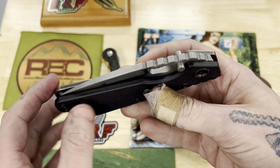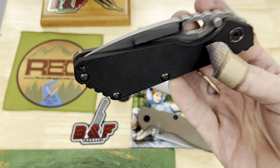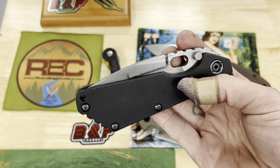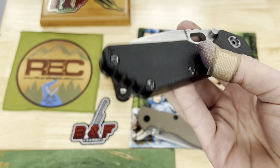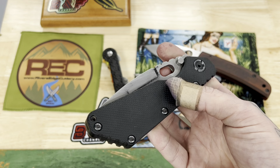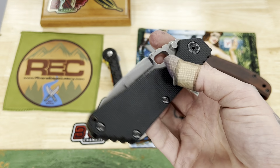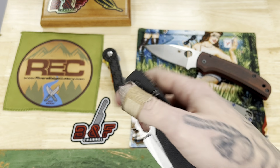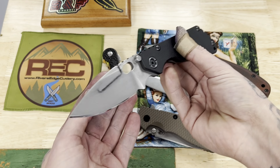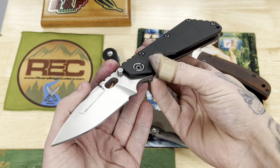This is the SMF, so this is a super fat blade stock. When you see the bevel on this, I guarantee nobody would ever guess that this edge is sharpened at 24 degrees per side. And that is with the angle cube, the actual degrees per side. On the KME, it was a little bit above 25 degrees on the adjuster. So let's take a look. Got to be careful because this already cut the shit out of my thumb once.